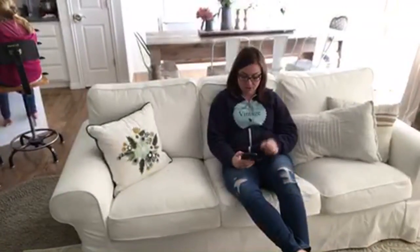All right, we're going to sit down, and we'll answer your questions now that it's drying. We are going to seal it. We'll probably seal it with Big Top, but we can spray the sealer on, and sometimes what we do is we spray it, and then we move it inside so it'll dry faster, because the sealer is really temperamental when it's cold. So the sealer really wants it to be probably above 55. The sealer doesn't level out as well, because essentially, polycrylic or even Big Top is almost like plastic that you're putting on the top of things. So I think that's it. We are going to distress the edges.